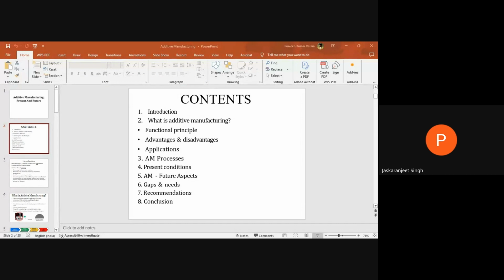So moving on, the next additive manufacturing technology is powder bed fusion. Powder bed fusion encompasses multiple high performance AM processes, including selective laser sintering, selective laser melting, and electron beam melting. These methods use a high energy laser or electron beam to fuse a powder material together, forming a solid object layer by layer. Selective laser sintering uses a high power laser to fuse powdered thermoplastic material like nylon and TPU. The laser selectively scans the powder bed, partially melting the particles in each layer. Since the surrounding unsintered powder acts as support, it does not require additional support structures.